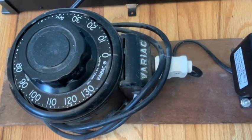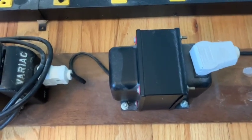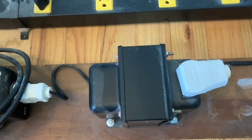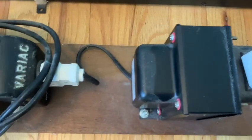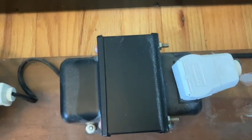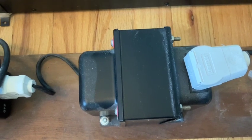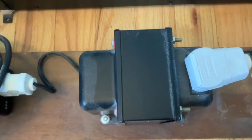From there a two-wire line cord goes into the isolation transformer — this is actually a Jameco isolation transformer. This video is not sponsored by anyone, and you can still buy this on the Jameco website or Amazon. You really do need to take it apart to rewire both its input and output properly, but it comes apart very nicely. The only limitation is it's really only good to about 300 volt-amps — around three amps — which is usually fine for most equipment you're going to plug into this contraption.